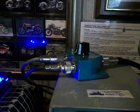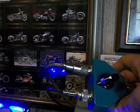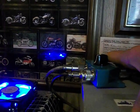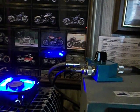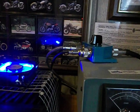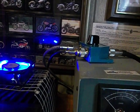Hello everyone. I thought I'd make a video here about this coax switch. When talking on ham radio, if you hook two radios to the same antenna with a T-splitter, when you key one radio down, RF will go to the other radio on the antenna and burn up the radio.